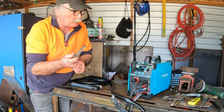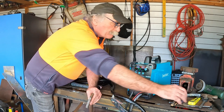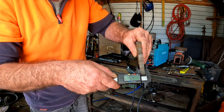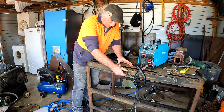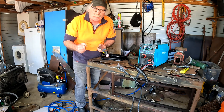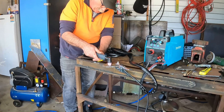Now my friends, we'll go up to 10 mill or 11 mill — let's check what that is. Oh, I tell a lie, it is actually 12 mill. Could you see that? That's 12 and a half millimetres, so it's a little bit thicker than I thought. Once again, Pete's rules are: put your earth lead as close to what you're doing as possible. Give yourself as much chance as possible to cut through what you want to cut through. Let's do it.